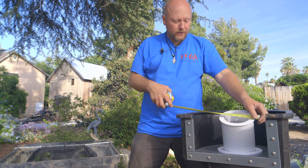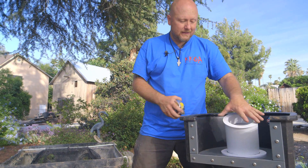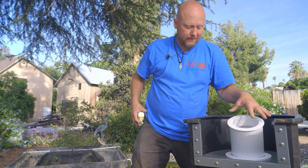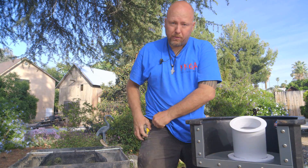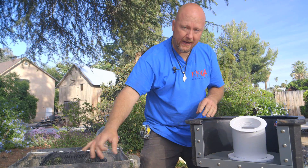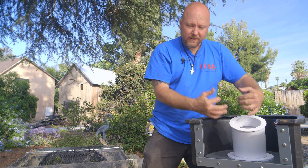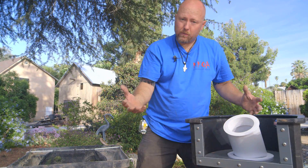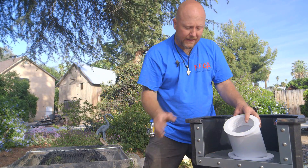Here's what's interesting: this is a six-inch weir, but it's a circular weir. It's six inches across, but if you measure the circumference, it's about 15 inches. So we have a great deal of water pull. Remember, the old skimmer had a six-inch or eight-inch doorway pulling stuff toward the skimmer. With this design, we have 15 inches pulling toward the skimmer — we're almost twice as efficient as their biggest model at that time.